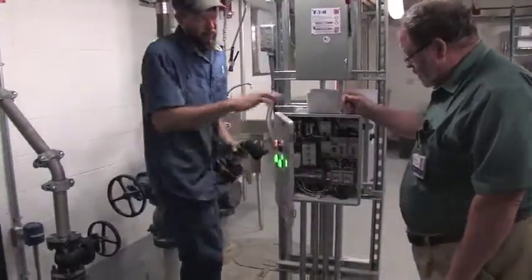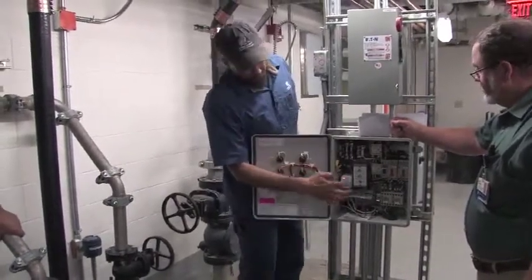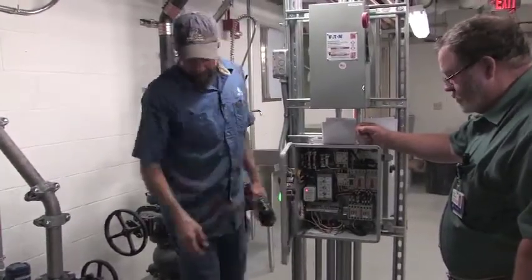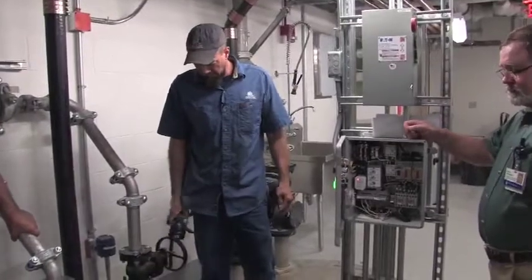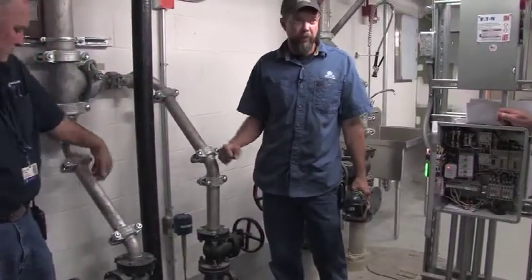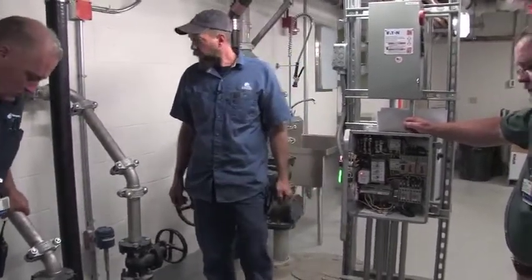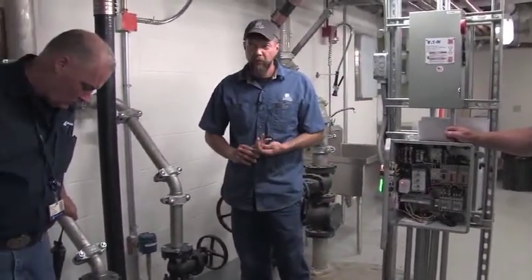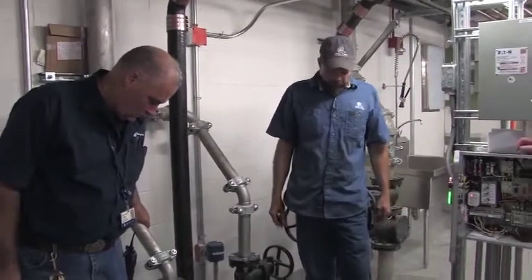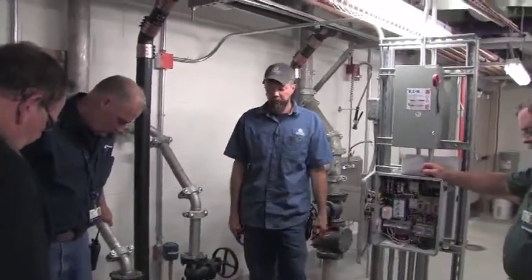I can test the alarm if I want — that's the horn. As soon as the bottom float flips down, the alternator will swap. Again, these alternators are Wylie specific for these panels. Two-inch discharge and non-rise stem gate valves. I don't think you have to worry about the piping rotting out — looks pretty good. Any questions or concerns? These ones are also on rails with retrieval cables. You may want to find some means of rigging overhead when the time comes.